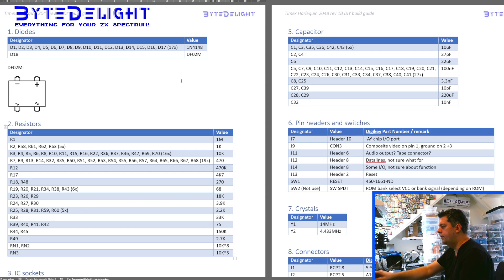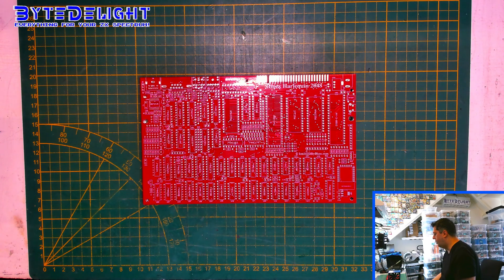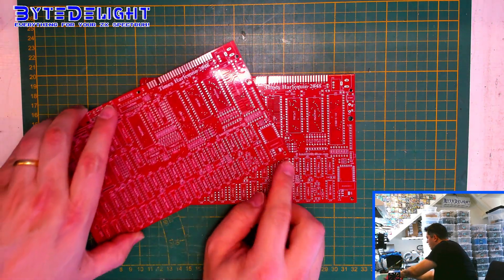I can imagine we need so many 470 ohm resistors, but it should be okay. I see that this is not sorted correctly, so I need to do a couple of things before actually putting in the resistors. I'll just start with assembling this board according to this manual. I'll do it in speed-up mode, and in between I'll talk about where I am and what parts I'm missing. For example, I may need to obtain the bridge rectifier — not sure if it's the same version. And there's another part, U57, which might be the power supply for the Wi-Fi module.